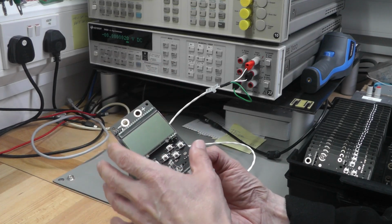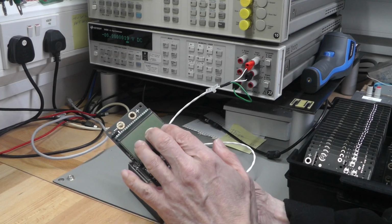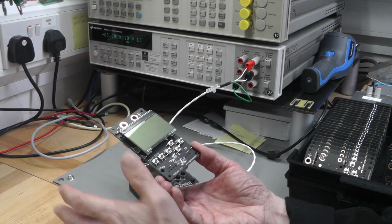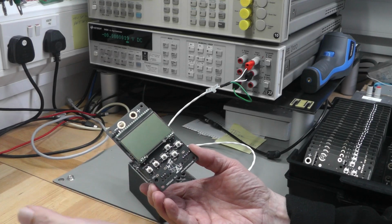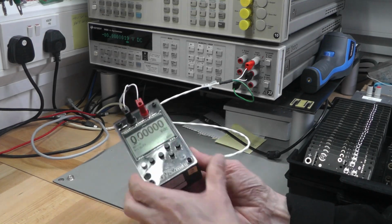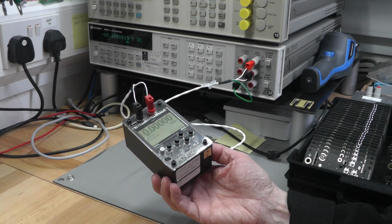Once they're cleaned, I would then assemble the real LM399, the battery holders, the LCD, the banana sockets, and then it's just a case of dropping it into the aluminium housing and putting on the keycap, then screwing on the acrylic cover. But I'm not going to bother showing that. The end result is a PDVS2 Mini like this. But then of course it does actually need calibrated, which is what I'm going to show you now.